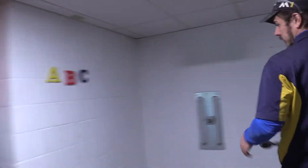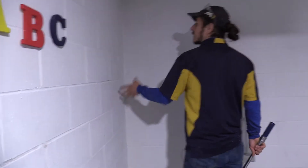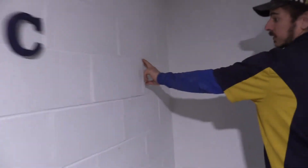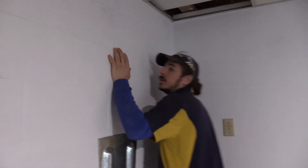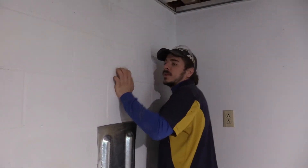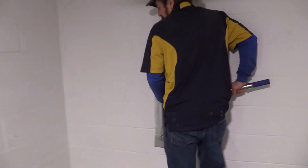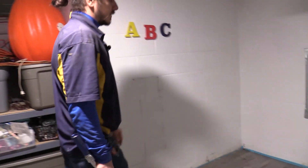This is the other side — the same wall. You can kind of see right here how this jutted out, talking about this coming out of the front of the house. You can see these cracks right here. This is due to this corner shifting when this wall came in. They did paint in here — looks like they came in and sealed this crack up. If you put your face on this wall, you can kind of see the bow. Like we said before, 80 pounds on all these. They have held their pressure over the weekend. And that's geolocks.